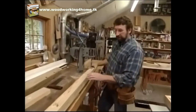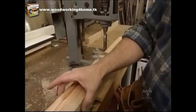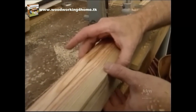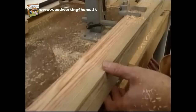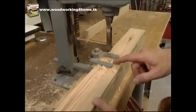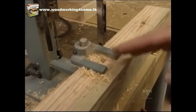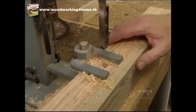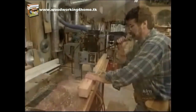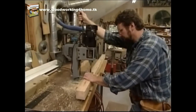Now I'm starting to work on the other pieces which will frame the gate itself. I took four-by-four material and reduced it down to two-and-three-quarters inches square. The piece I'm working on now is one of the vertical pieces at the edge of the gate. I've laid out a mortise where the curved section will come in, and there's another mortise down at the other end for the bottom rail. I'm using my hollow chisel mortiser set up with a half-inch chisel and drill bit — the drill bit does most of the work, the chisel squares it up.